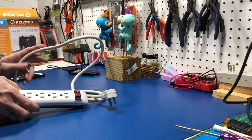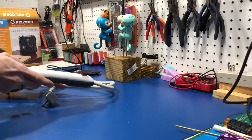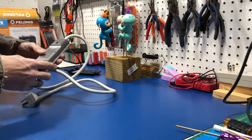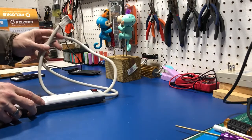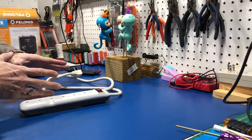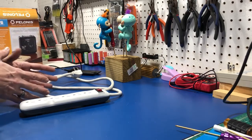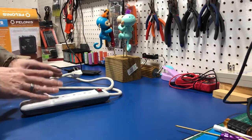These are very common cords for heavy current applications — heavy amperage — such as heavy extension cords and computer power supplies. This unit says it's rated for 15 amps at 125 volts AC, so the cord is actually rated higher than what the unit claims. My rule of thumb is 80% — if you want something to carry 8 amps, use a cable rated for 10. 80% is where I like to stay.